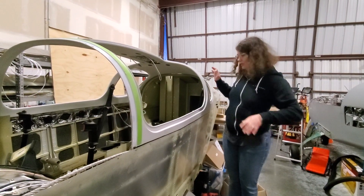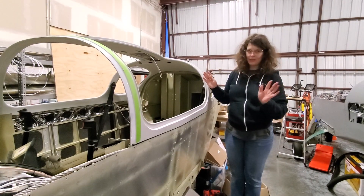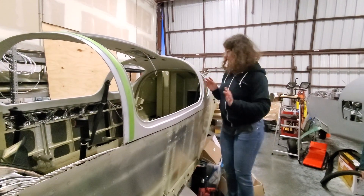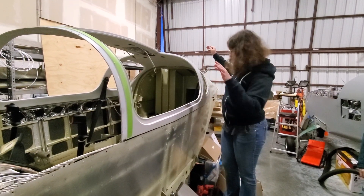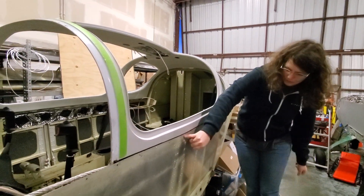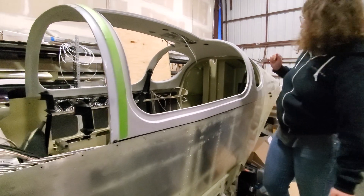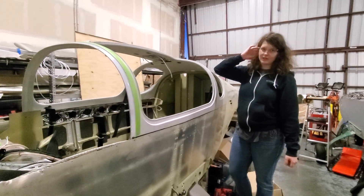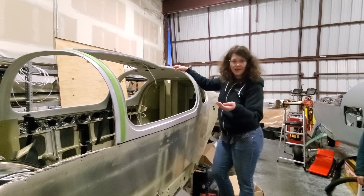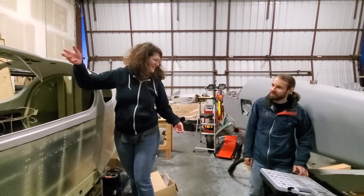We spent a little bit of time trying to mount this in the correct place. We didn't trim the canopy at all because we didn't think we could do it any better than Taft did, to be honest. We used four giant clamps basically to position it roughly where we want, so that the gap between the skin and the canopy was less than an eighth of an inch all around. That's what we were prioritizing, and other than that it was pretty smooth.